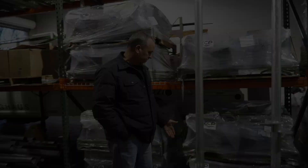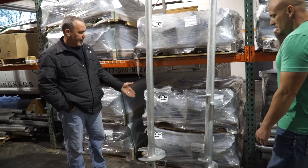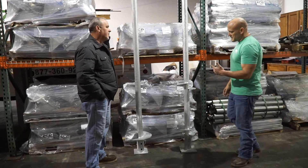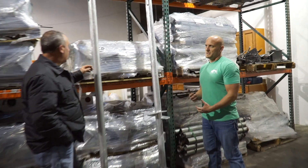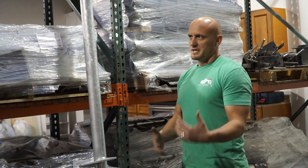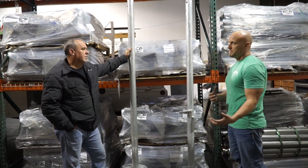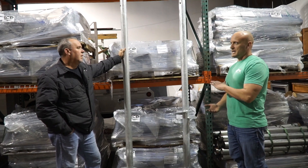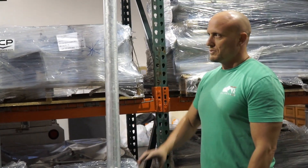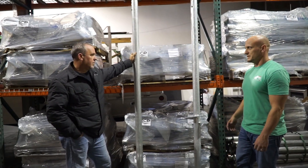I see we have two different ones here. One's got a fairly large 12-inch blade, and this one has an 8 and a 10. Why the difference — one big one versus a couple smaller ones? The blade size is dependent on your soil conditions. In really dense soils, you're not going to be able to use large blades — you'll lock up in shallower depths where there may still be pockets or cavities of less dense material that could cause the house to settle. Smaller blades can go through with less torque and resistance, reaching deeper depths in denser soils.